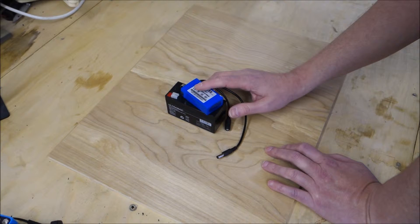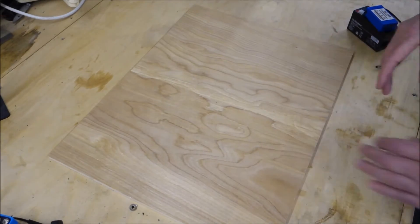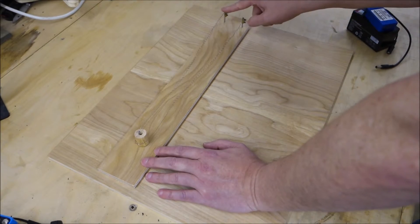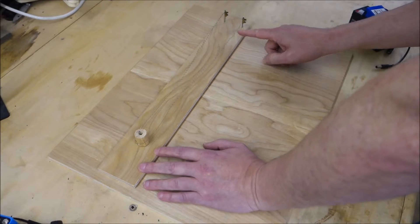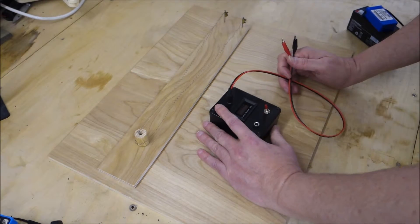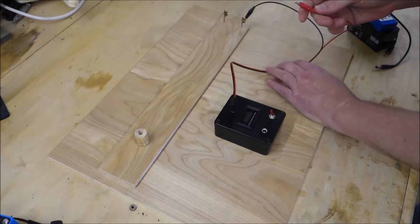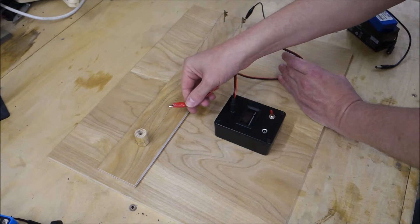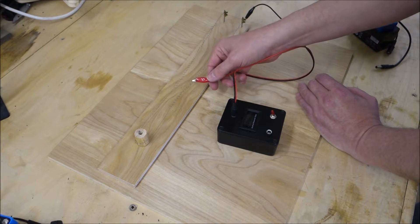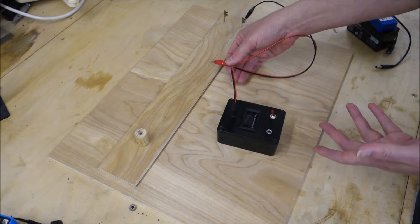So what I'm going to do today is actually test some of these batteries to figure out the maximum safe discharge rate for each type. I've made a simple test rig — it's just a piece of plywood with a couple of nails at the ends, and this wire is heating element wire, the same wire used in smoke generator heating elements. We'll attach the wires from our test rig so that one end goes to one end of the wire, and by placing the other contact at various points along the element we change the resistance and draw more or less power — creating a gauge showing the current drawn at each point.